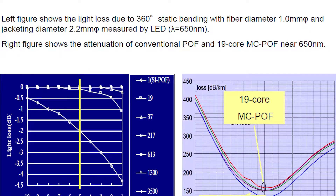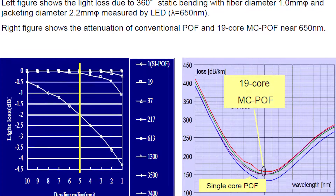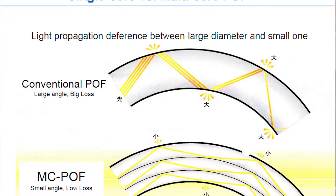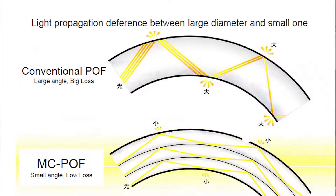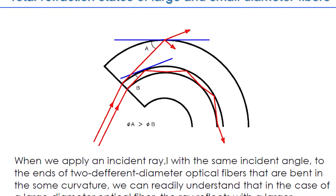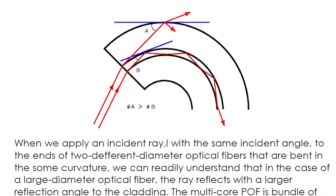But what they're doing there is, depending on applications, it's done so you can have flex cycles or really tight bend radiuses, because you've taken this typically one millimeter fiber and divided it into 19. So now you can get down to like a two or three millimeter bend radius on a lot of these fibers.